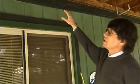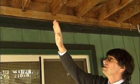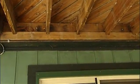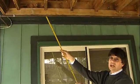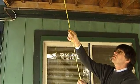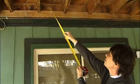When I walk up to a deck to inspect it, the first thing I'm always worried about is how is the deck connected to the house. In this particular instance, we see that we have an overhang from the house wall to the deck, which is always a bit of a concern. The deck is attached to the house through this ledger board, which I'm pointing to with my tape measure up here.